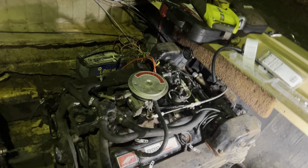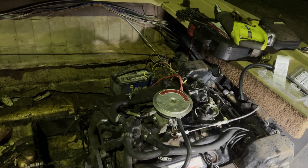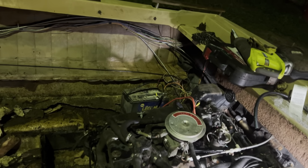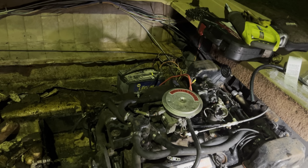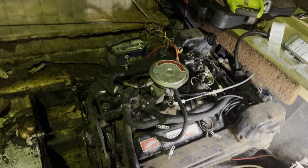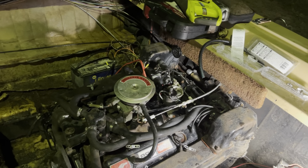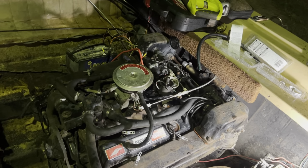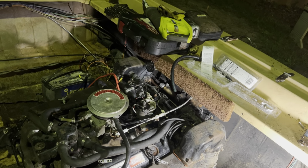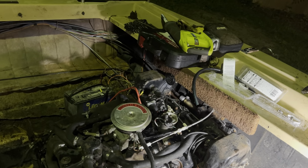It's a little bit slow, but that battery is an old battery that we dug out of one of the vehicles in Coby's junkyard back there, that we only let charge for about 5 minutes off jumper cables hooked up to my truck. So it's got 12.1 volts, but it probably doesn't have a whole lot of amps in it. So I'm not worried about it turning over a little bit slow right now. And also, it's probably barely made 5 full rotations in the past 20 years. So it's going to have some rust and stuff that it's got to fight through.